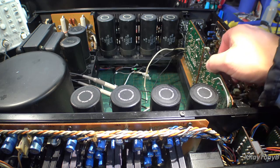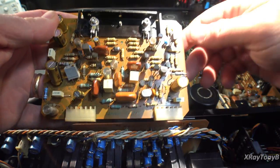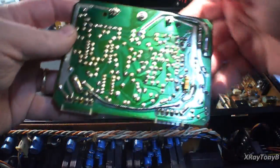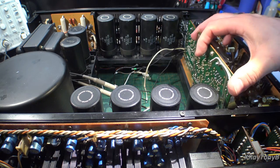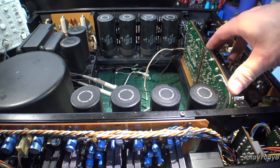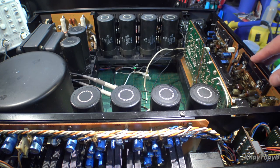On some of the boards I actually relocated the jumper wires — they had these giant loops just coming up over here, like big antennas. I actually rerouted them on the rear of the board. When I did that it really quieted this thing down. I have not been able to make it oscillate — not at all — and I have been messing with this for a while. So I think we've solved all the instability problems and removed the oscillating problem from the amplifier.